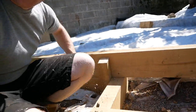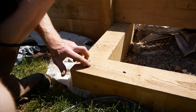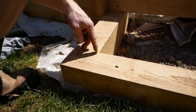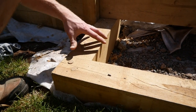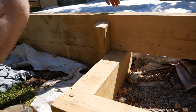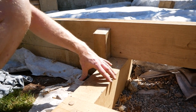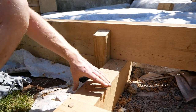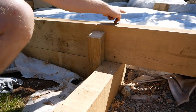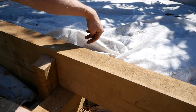And this is the mortise and tenon step. So it's pegged. I put two pegs in, more for aesthetics than anything, but that's got a tenon in there. And again, this is anchored in here onto the corner post, as are these. So that's locating those. What you can do if you wanted to hide the post is extend this in further, like I did on the other step, and then you put your post in that corner and bolt in that way.